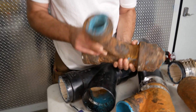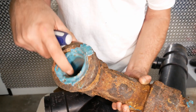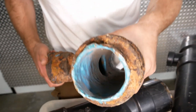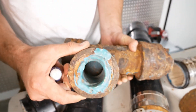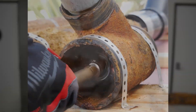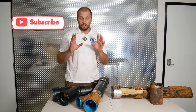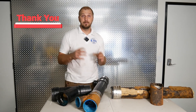With brush coating — I have many examples — on a three-by-two reducer, you'll never be able to get a two-inch liner all the way in through all the turns while keeping the pipe fully open. But with brush coating, it's completely epoxy-lined with no free spot. The pipe is 100% lined, holds pressure, holds water, no problem for the future. The hardest part of the work is descaling, cleaning, and preparing the pipe. Watch our other videos to see the difference between a good job and a bad job, and compare pull-in-place liner to spray and brush coating.